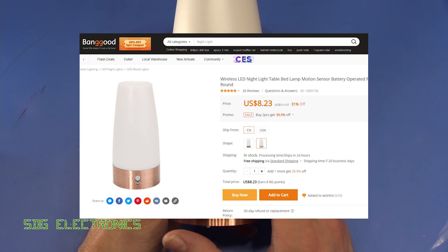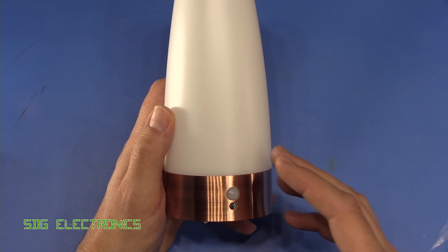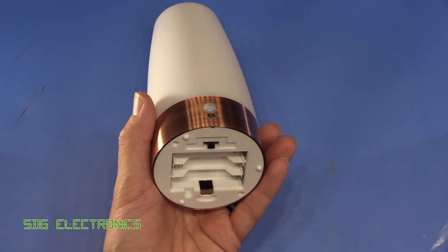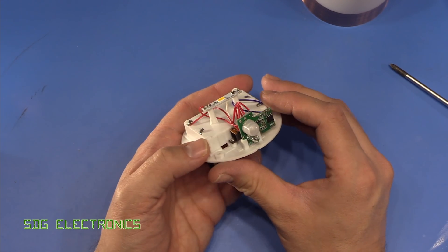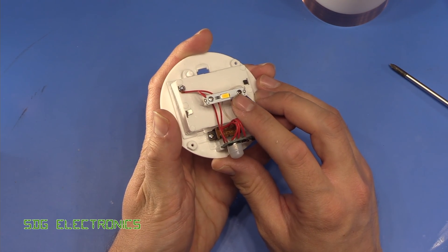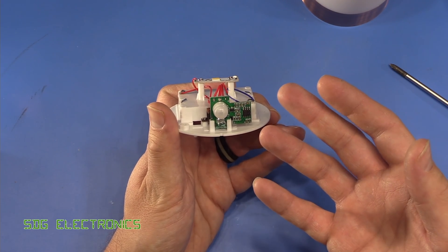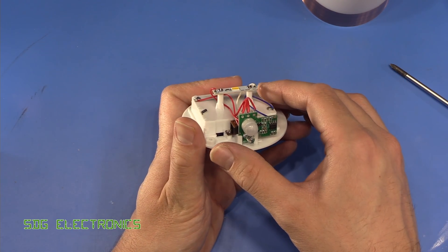The main problem with these is that they were way too bright. There's a little PIR sensor so that when you start moving the lights turn on — they just turn on instantly and at quite a high brightness. It's got a nice diffused cover and takes three AAA batteries with very bare bones electronics inside — a little PIR circuit and a single white LED. Originally I just changed the resistor so it wasn't very bright at all, but I wanted something we could leave on all night at a very low level and then turn up a little bit when needed.